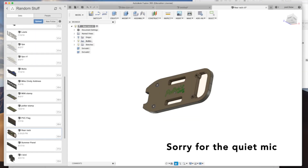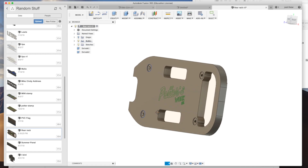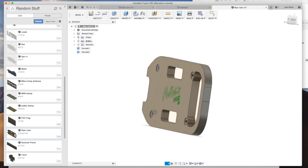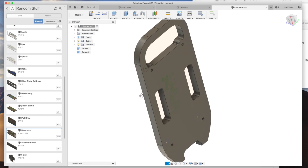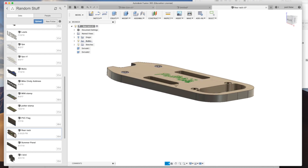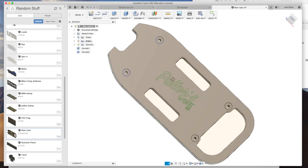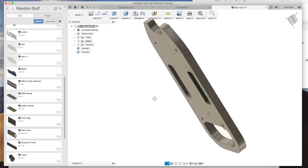Here's the design I came up with for the back of the bike rack. I still have cutouts for the bungees to go through, mounting holes here, here, and here, and a recessed area next to the mounting holes for a stainless steel washer so it'll sit flush. The bottom is going to look like so. I also need to adjust the depth — this will be a half inch thick instead of three quarters — and I have my Potter's Work logo that we'll engrave into the top with a V-bit. I just need to finalize that depth, make my tool paths, and we'll get going.